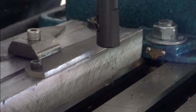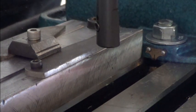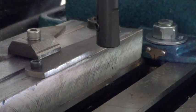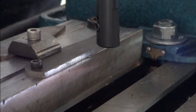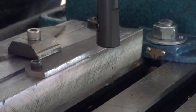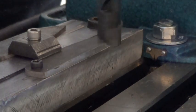Okay, so this is my blade fixture. I'm going to first touch off to get 0, then take a skim cut of about 30 thou, which should be roughly half of what I need to go down, and that will show me where I'm at and if my angles are right. It's a 3/4 inch indexable carbide running at 850 RPM. Seems to be what the cutter's happy at. Come in here. Just gotta touch off.